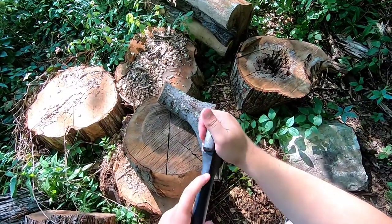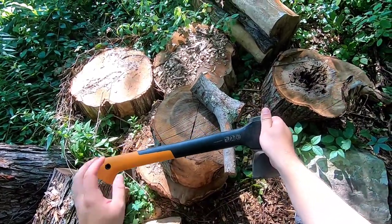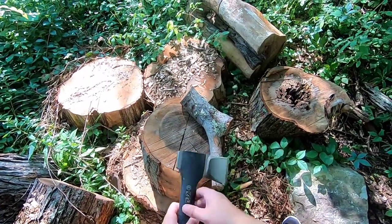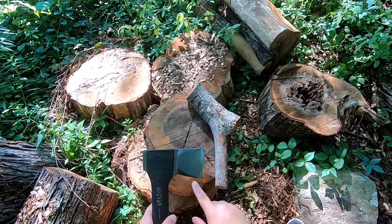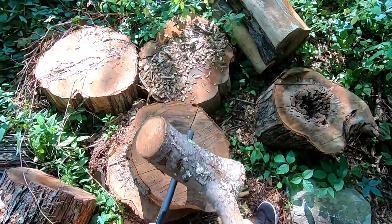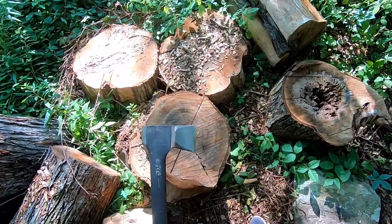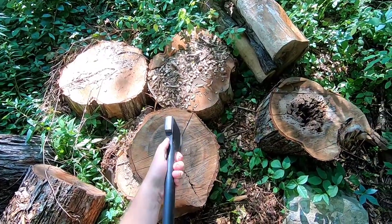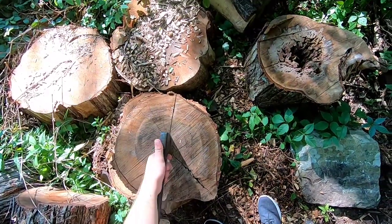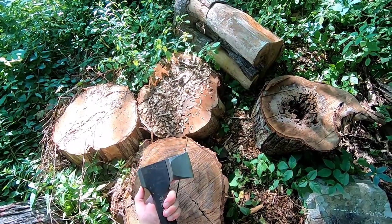You want to tap this reasonably lightly because you don't want to damage it too much, and you don't want to hit it down here — one, because these handles are usually very flexible, at least to some degree, more flexible here than they are here — and you really want to work on this axe head, trying to move it and wrench it little by little up out of that tough situation you put it into. You want to tap it very gently when you do. You'll notice I'm not really hitting it in the same way I would strike it to drive it into the wood, because you don't want any extra wear and tear on the connection between the handle and the axe head, as that's just going to reduce the life of your tool. Wrenching axes out of wood tends to reduce the life of your tool no matter the method, especially if they're really stuck in there, but this minimizes the damage.